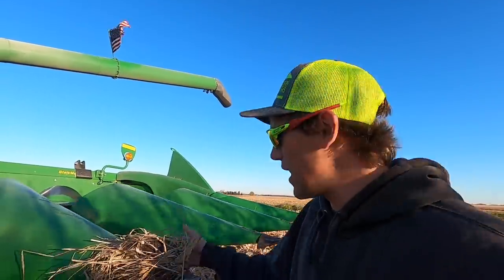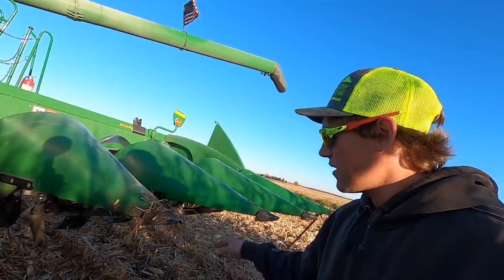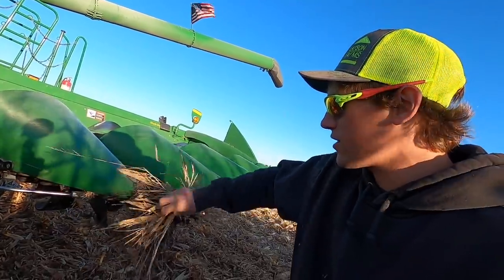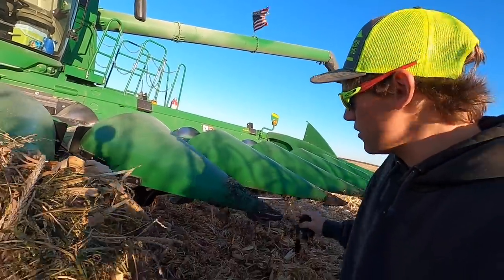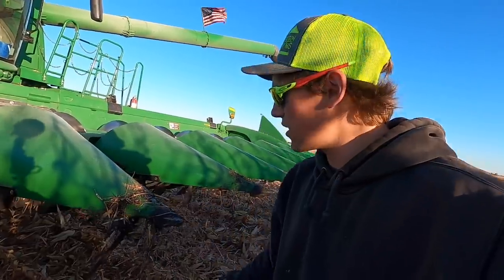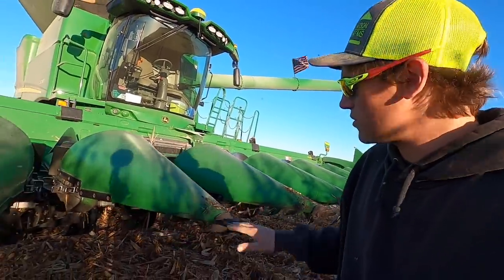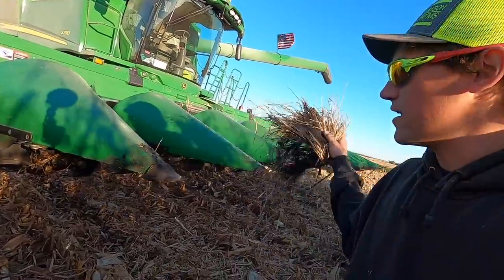The field must have got a lot more rain because it is pretty wet out here, and there's a few suppressed areas where the grass grew, and so I lower the head to get under the shorter corn, and then this grass gets stuck on the snoot. Then when you go cut in on the headlands, because we're trying to open the field up, these big clumps just break the corn off and push it all down, because it's supposed to slide nice. Ah! Great way to start.